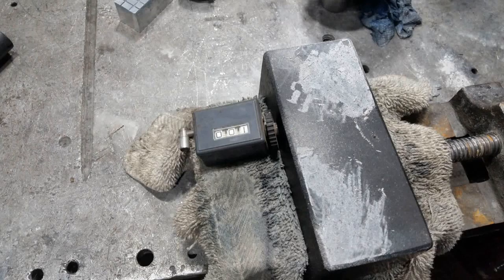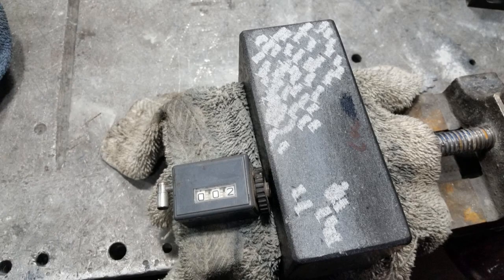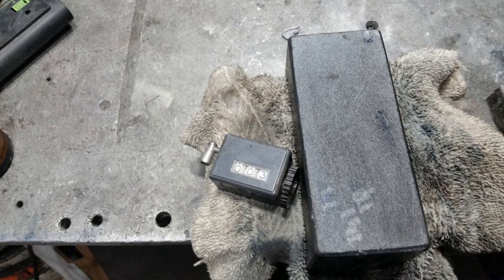I'm just getting going straight on this last side here. I've got over ten thousandths to take off of the one side, so it's a lot of material. I'm using a combination of scraping and a soft lap — a hundred grit diamond pad — to just bulk take down the material. It doesn't keep it flat, but it does take material away.